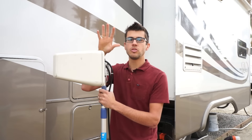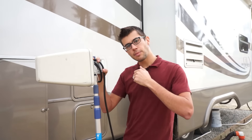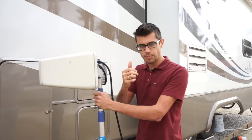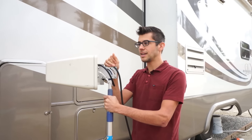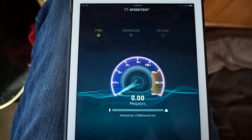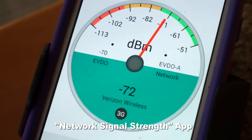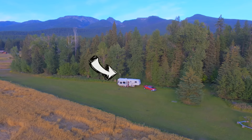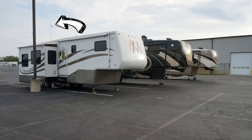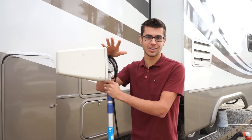To get the best signal quality, you want to find the cell tower. For us, we're usually boosting internet. What we do is I come out here with an iPad, create our Wi-Fi network, put this up, and then I start taking speed tests and rotating this antenna until I find the fastest data rate. Even if we have pretty good cellular connectivity, this will always increase our data speeds. We usually get about a 10 to 15 dBi boost on our cellular connectivity. It helps with both voice and data, but it always increases our data speeds. With this setup, there have really only been two places in this entire country so far that we've found we could not get any cellular connection.